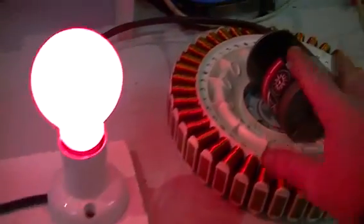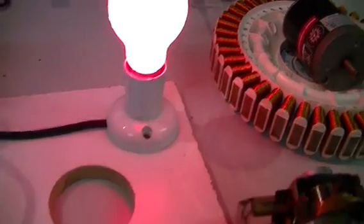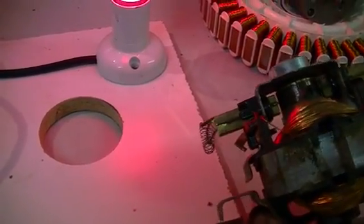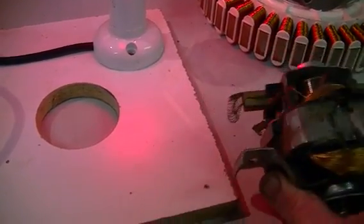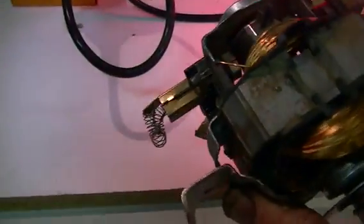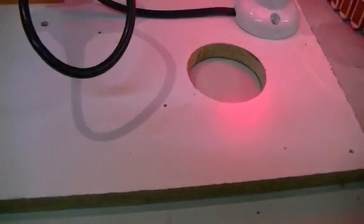That's a 24 volt DC motor that runs quite fine on 12 volts, just a little underpowered. This one here started life as a 240 volt series wound motor, which we'll be modifying to run on 24 volts — not hard to do — and then we'll be carrying our little mods here and there with our coils and our stator core itself.